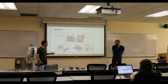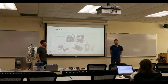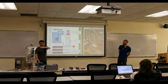We came to the conclusion to use two separate motors. We can design two completely different systems that work in line with each other using the same motor, ESC, and power system — they're duplicates of one another. We overpowered the IPA pump motor so we knew it would work for both pumps. That's the final design we ended up on.